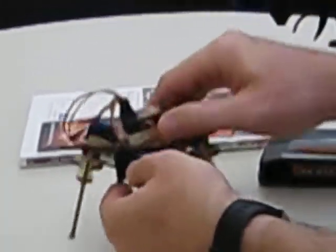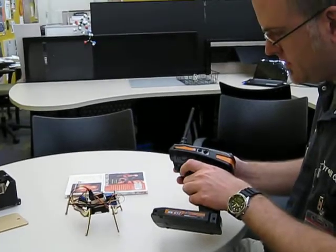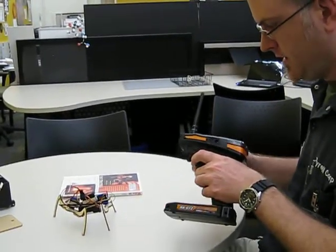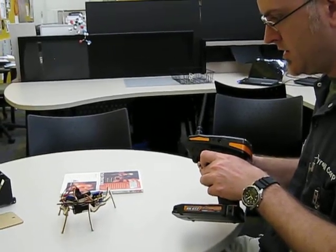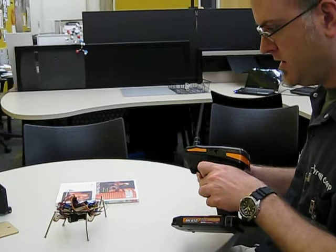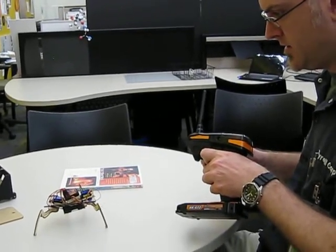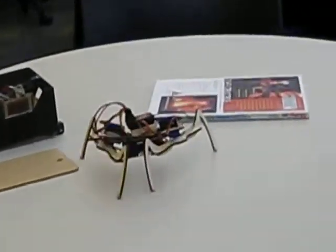You can see here the body has an angle to it, which will make sense in a minute. Using the two different servos, you can see it starts to lift its leg up off the ground — that allows it to have the freedom to step forward. Then it shifts its weight forward onto the front leg as you shift the rear legs forward. You can see it drops, and that's how quadruped motion works with four legs.